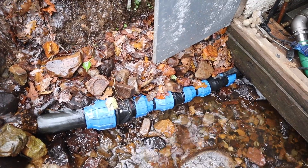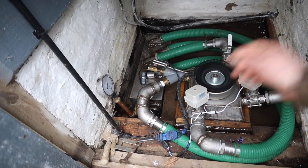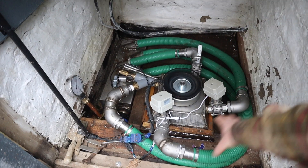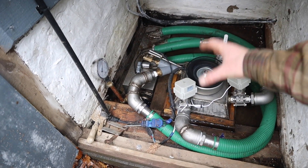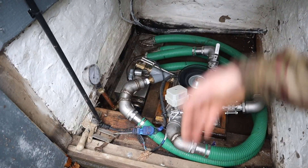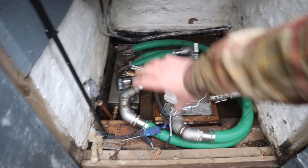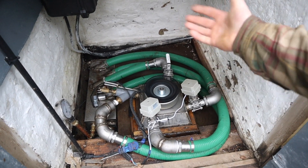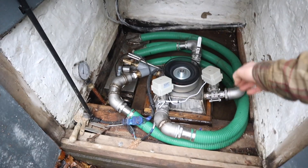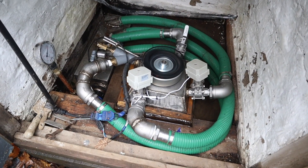As far as the intake is concerned, yes there is turbulence and losses in the intake box, but we need to look at the bigger picture. That intake box allows me to run all of these different nozzles individually, which lets me run the turbine for more days per year. Although there is a loss in the intake box, having the four nozzles is important so I can run it for a longer proportion of the year. If I could just have two nozzles — one spear, one fixed — with the pipe going straight through with fewer fittings, that would be ideal. When I design these for sale in the future, I'll do that depending on the system, but my changeable flows mean four nozzles let me run power for longer periods, and I just have to accept those losses.